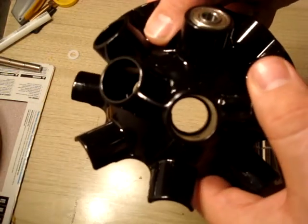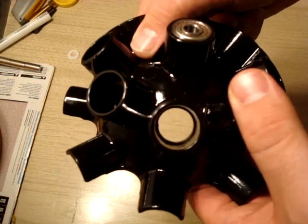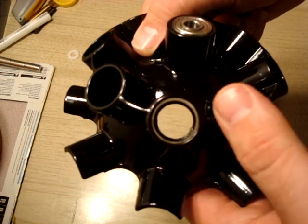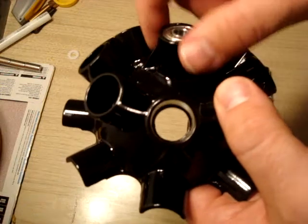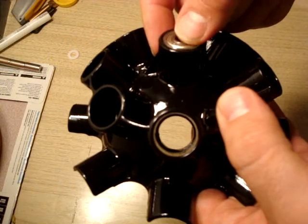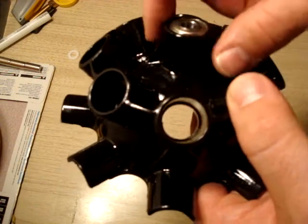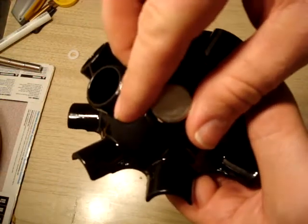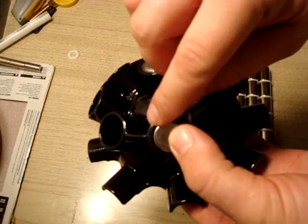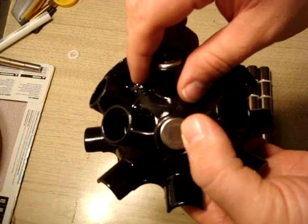If you look directly down in here, you can see this little lip down here in the bottom. You can see where my finger is down there. You can see that lip. It was actually discussed and brought up by one of the TEEP members, on the TEEP forum, which is where this motor is being designed and updated. Please come and join us. But what this is, that lip, if I just go ahead and put this magnet in here, and I zoom out just a little bit, you can see that there is a gap around that, so this magnet does not fit in here correctly.